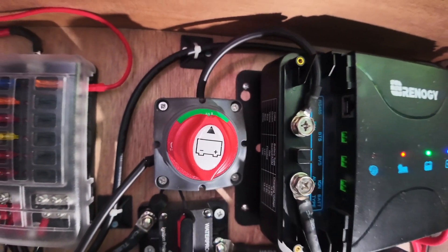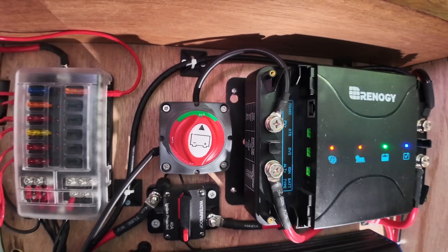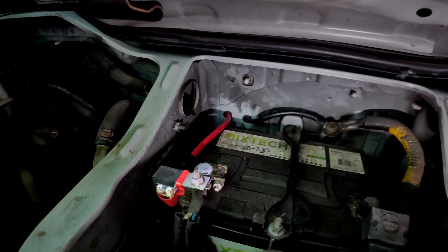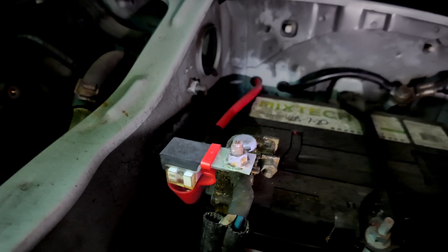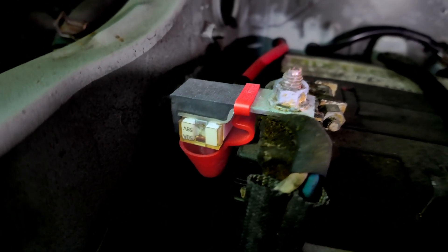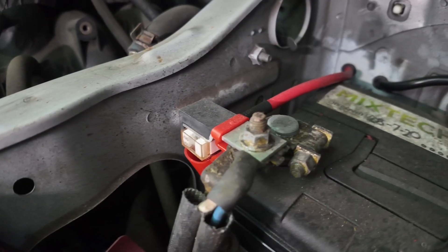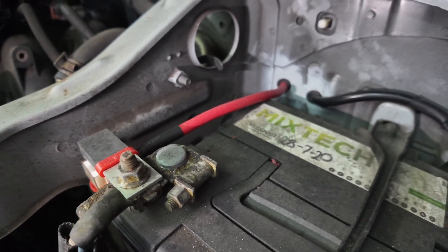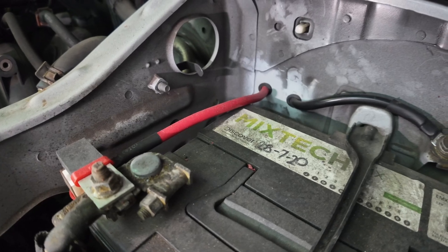In addition to circuit breakers, you'll also see in the diagram a kill switch — a simple on/off switch running between the solar panel and the battery charger — because solar can't really be regulated and the panel is always live if there's sun on it, so it's good to be able to shut that off when needed. And finally, for the car battery, the best thing to use is a terminal fuse rather than a circuit breaker or ANL inline fuse, because it bolts directly onto the car battery itself, fusing right at the source without having to fix the fuse anywhere else in the engine bay.